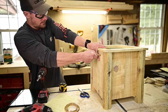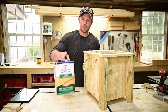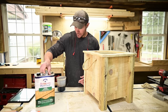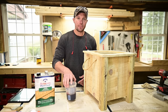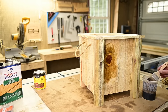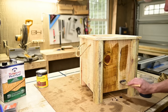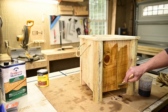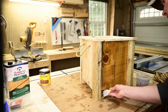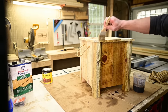For finishing, I like to use Thompson's Water Seal — this is the clear version, but you can get stained versions too. I prefer to mix my own stain, so I pour a little stain in and mix it with the Water Seal. Just take a cheap brush and brush it on to seal everything up. I've used it on planters sitting out in the rain for a while and it beads off the water really nicely.